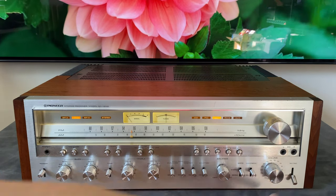So let me show you another thing that can happen from time to time. The card in the 1250 in front of us had previously been worked on, and it looks like someone was just grabbing miscellaneous caps out of their drawer. I've never heard of this brand. There's another winner. The only real part that I found in there was an Elna, and this might have been a pull from another unit. You never know. So that's another reason I like to replace everything on the stabilizer card: they're prone to failure, and it's possible they've been worked on in the past. These were obviously some subpar caps, and some of them were the incorrect value in the incorrect position. So I wanted to get those out of there.